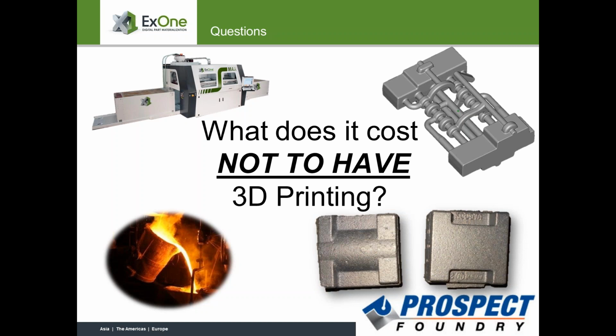No, again, is 3D printing great for every application from a cost perspective? No, there are times when it can be a question. But nonetheless, when foundries in general are running into some problems, it's often worth testing and trying 3D printed cores, because of some of the downstream benefits we see in other industries. For instance, in the pump industry, with one-piece impeller cores, they're able to reduce the vane spacing and tolerance stack up, and eliminate downstream balancing issues, and have better performing pumps that arrive at foundries. And a lot of these things are often overlooked unless you experience it, I think, moving forward.